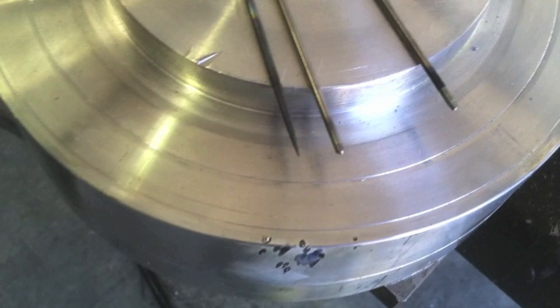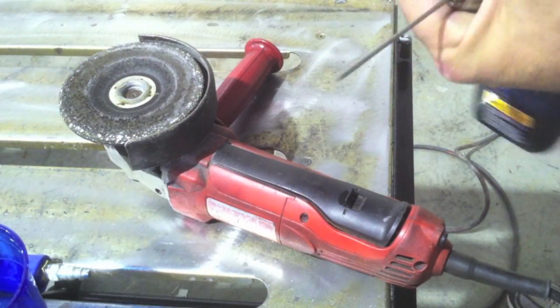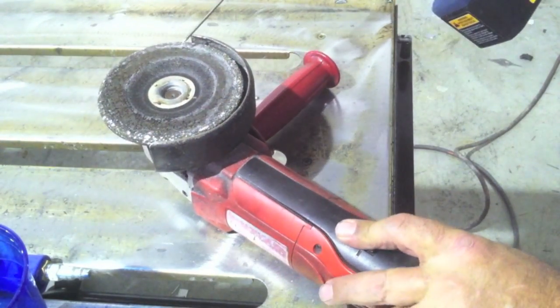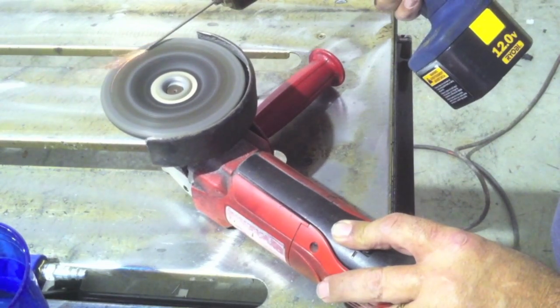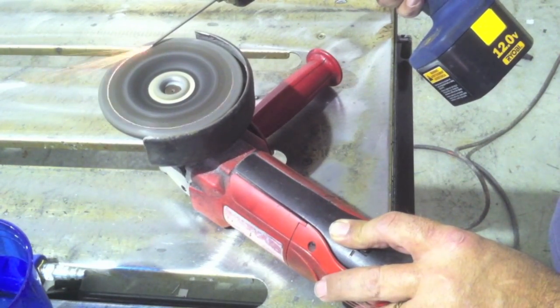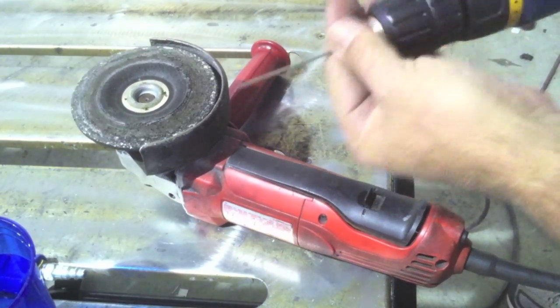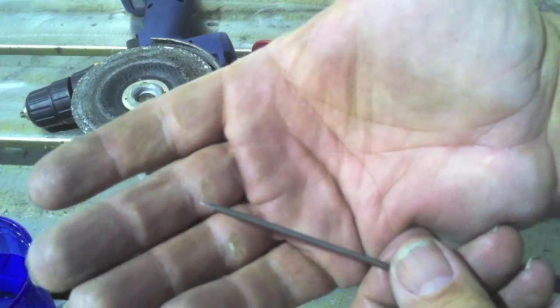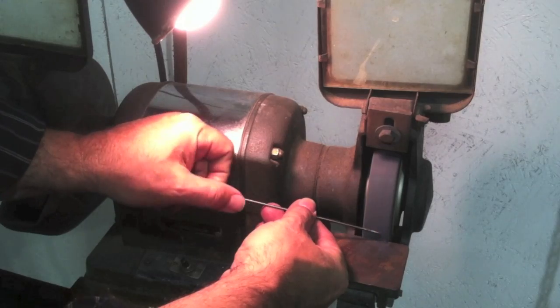Now, here's one on the left side — you can see it's a long taper but it's black and oxidized. If you do this method, you need to light up on a piece of scrap and let that stuff outgas. This is a rough way to do it — just using a regular grinding rock on a 4½-inch grinder, chucking the electrode up in a little cordless drill. Most people have a grinder and a cordless drill, and it works. It's just a little rough, but I do it all the time to be honest. For a lot of jobs, it's okay.